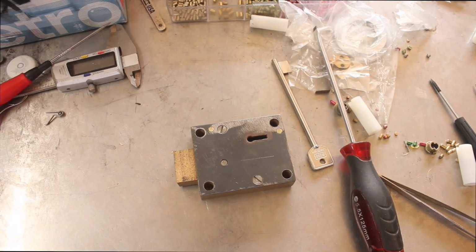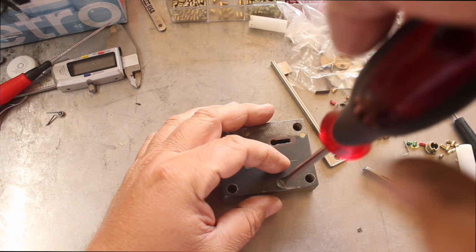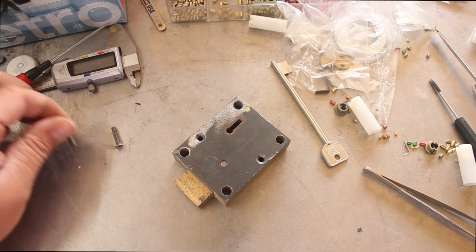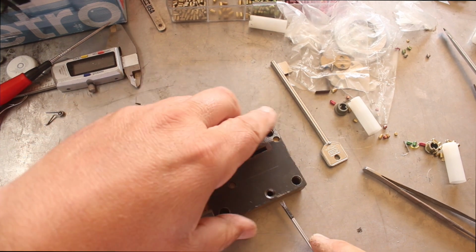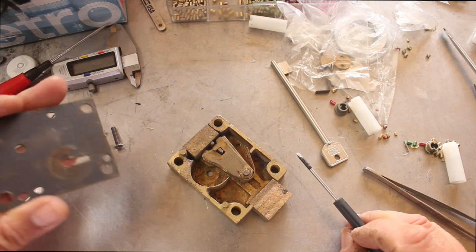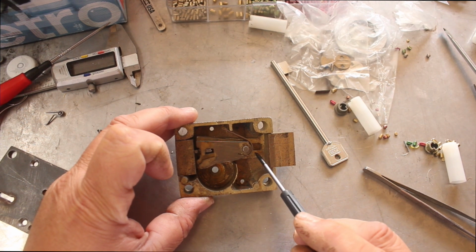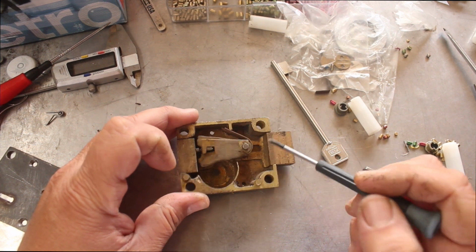There's a little bit of play there, so it might not even be suitable, but I'll have to have a look. Okay, so now let's have a look at this particular lock and let's see what is inside. So I'm guessing this is a 6-lever lock, judging by the case and all the rest and the way it's made. It looks either handmade or low production or quite old. What's inside? Okay, so there we go. Mild steel front. So no curtain. It's in the open position at the moment. Bolt throw is down the back, and we have levers. 1, 2, 3, 4, 5, 6 levers.